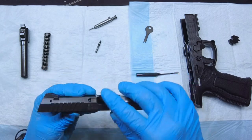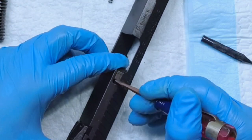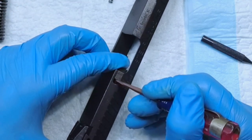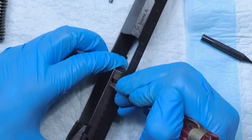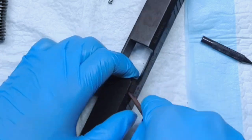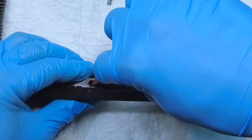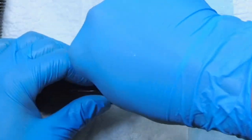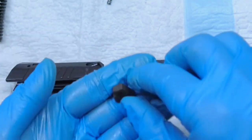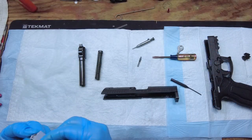Once you do that, you're pretty much done, except for the ejector port, which is quite simple. You need to press this detent back to relieve the pressure off of the ejector pin. I'm using a little screwdriver — it comes out just like your typical SIG Sauer. I'm using a too-fat screwdriver actually; if you can get a smaller one, you'll be able to get that out a little bit easier. There's your ejector, which is quite dirty.